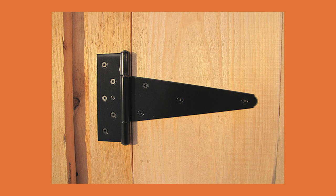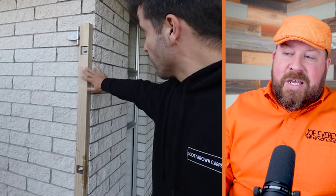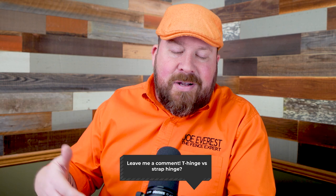The other problem is you have to use what's called a T hinge, which just means you've got a vertical upright and then a horizontal T to hinge the gate to the post. So the horizontal part sits on the post. A strap hinge is where it's just a longer hinge, and it spreads out the load of that gate over a longer portion of the fence. Now, obviously, attaching to the house, he can't do that, so he's limited to a T hinge. It's a mixed bag. I don't prefer T hinges. I think they're weaker than a strap hinge, but I'm sure someone will comment below that they think differently, and that's fine. Let me know what you guys think on T hinge or strap hinge. It's probably potato potato, but let me know what you think.